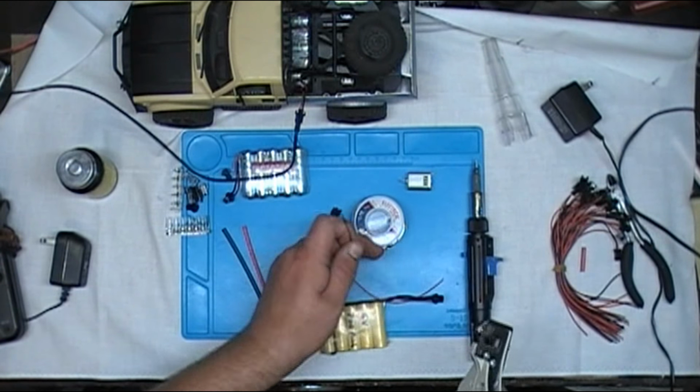Taking the black connector, I will solder it to the white striped wire. Giving that a second to cool down, because if you go yanking the shrink tubing over it now, it'll shrink and constrict and you'll have to cut it off and start all over. So, pulling it down. You can actually do this with a heat gun, a lighter, or another reason why I like the butane ones, they have this hole in the front, and that's kind of a heat gun for shrinking the tubing. Being careful not to heat your finger, of course. I always try to get away from it. Alright, that one's nice and on there, really good.